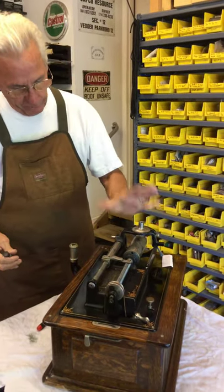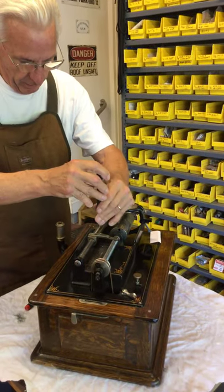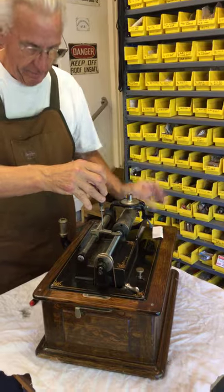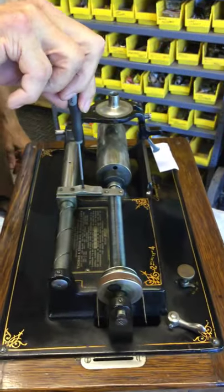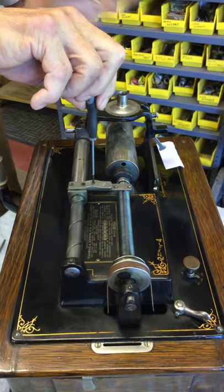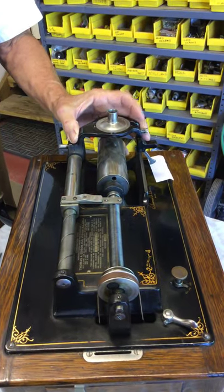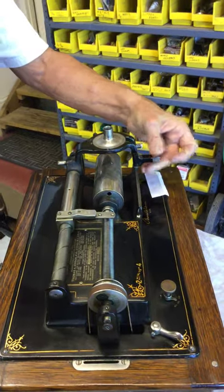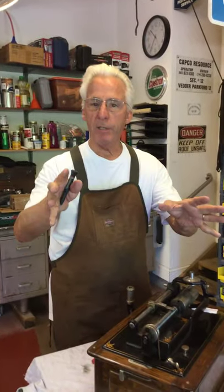So when you set the tracking, you play the machine. If it's not engaging, you're going to take the tension rod — this tension spring in the middle between the other two screws — and you're just going to give it a little turn, a little turn at a time, until you get that. You want it just floating. This isn't complicated, and that's my tip for the day.